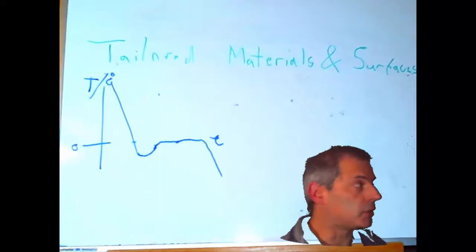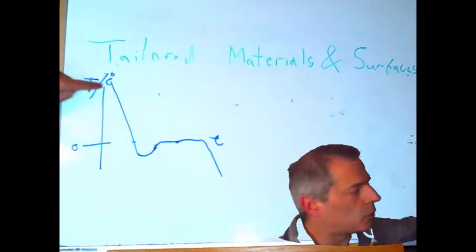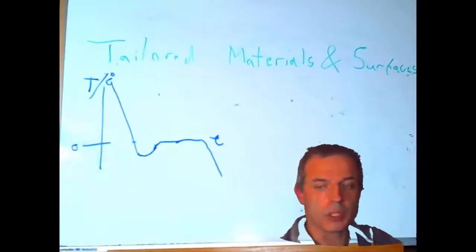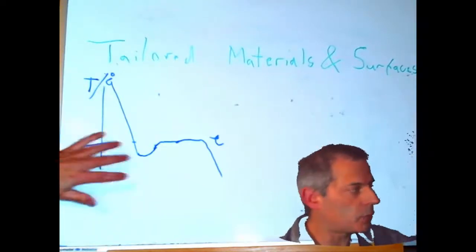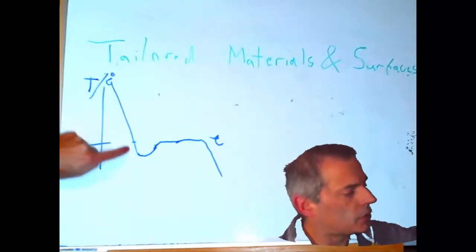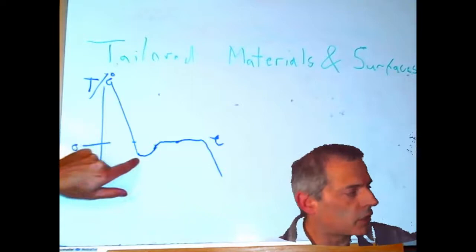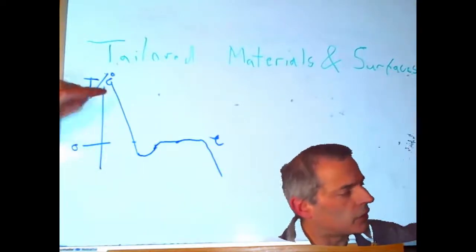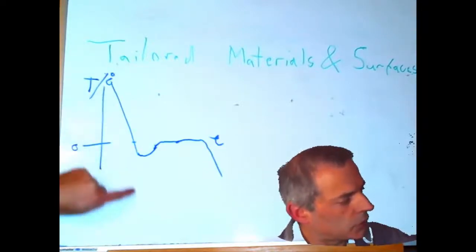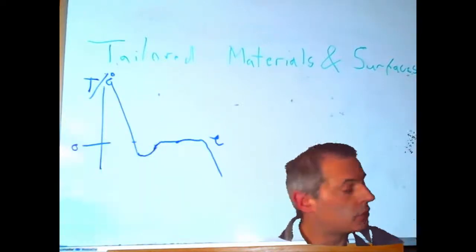As a reminder of a similar situation in another course, if we cool water down, typically we will get below 0 centigrade and nothing will happen at all, because we can't generate ice particles. It costs energy to generate surface until we get down to maybe -9 degrees, maybe -5 degrees, depends on the situation. Then ice starts to form. So we're cooling it down at a constant rate, taking energy out of it at a constant rate. So it should be cooling down in a straight line, but it doesn't, because when it starts to freeze, it warms back up to 0 degrees.